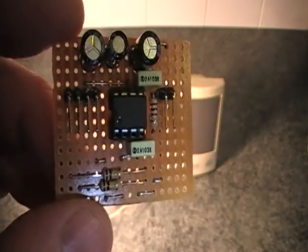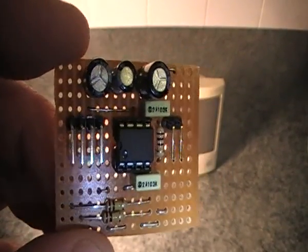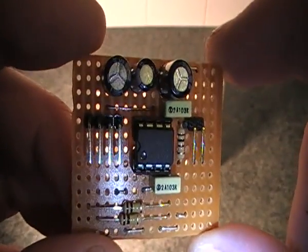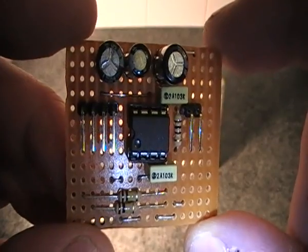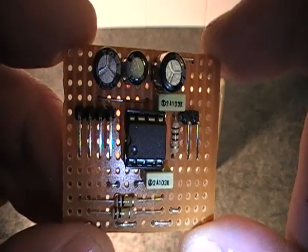This is a simple audio amplifier which I'm going to use on my battery powered Raspberry Pi's. It doesn't take many external components, it's very simple to put together. I'll put it together here on a stripboard. It uses an IC which is an LM386.